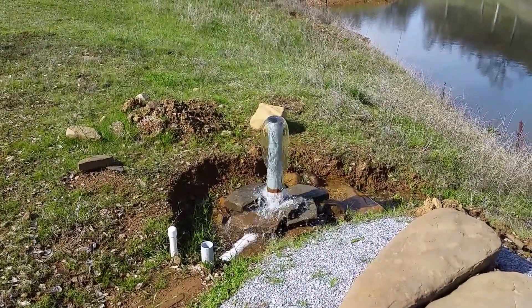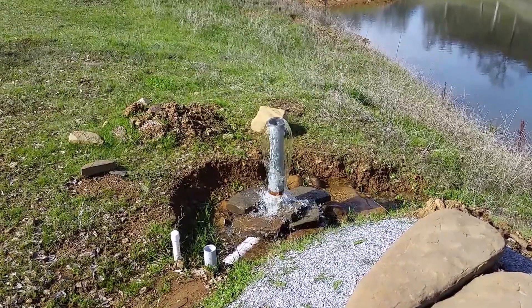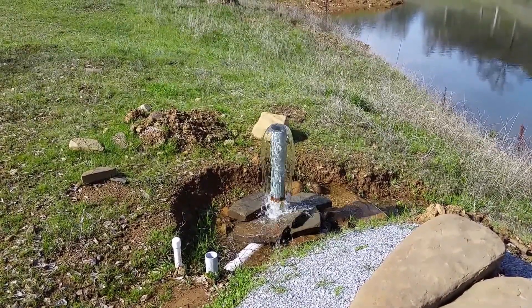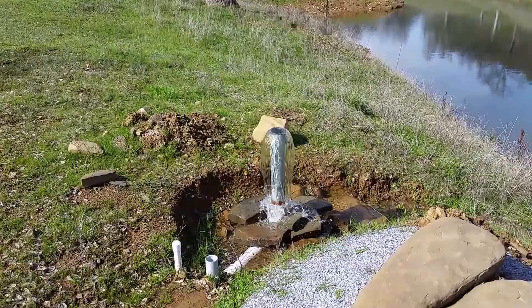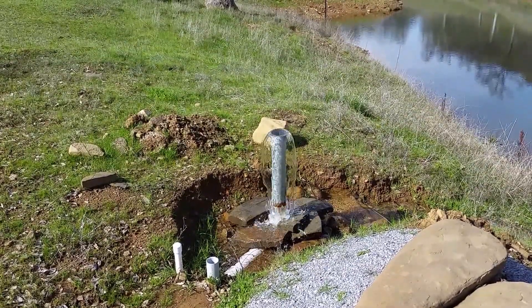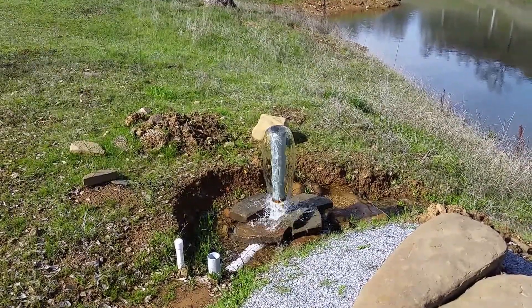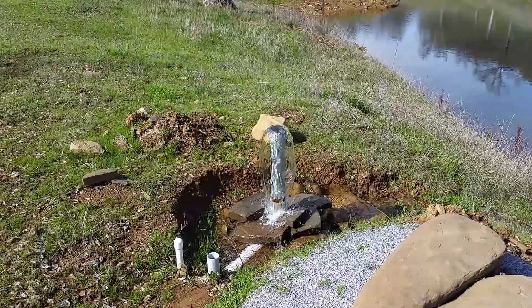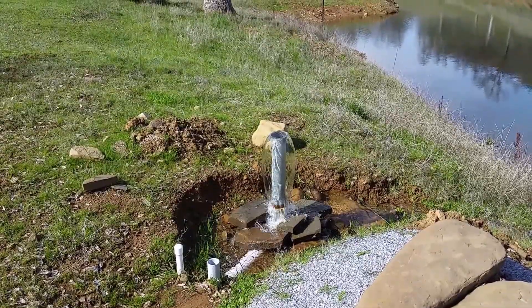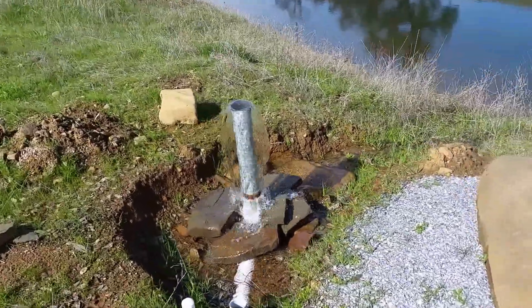Kaya moves out of the way and you can see that was a pretty decent increase in the flow just from her moving away from the panels. Now move your sweater out — okay, that's full flow. We didn't see a massive difference there, but just by unloading the primary panel we can see quite a bit more water flowing out.